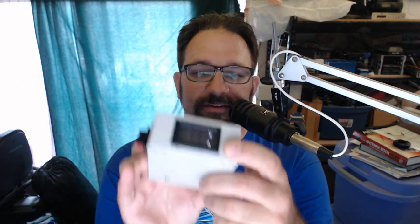Turns out, it is really easy to measure current in the ground lead, the negative lead of your power, for various different reasons. It's easier to measure it there, between like 0 volts and 0.01 or whatever across your shunt, rather than at the top end in your 12-volt line. And so these current meters do exactly that. So there are two pins that go in to power the module, right? That's just the power supply. It doesn't have anything to do with the metering. It's just powering the meter.